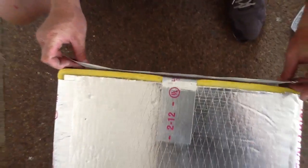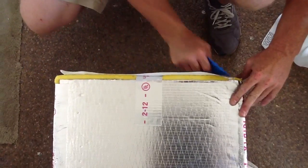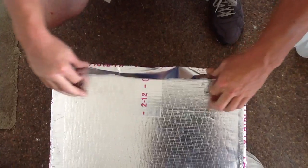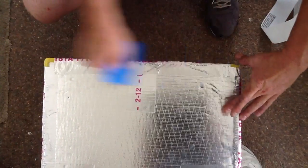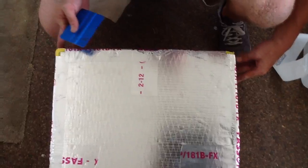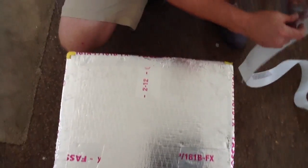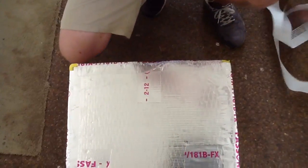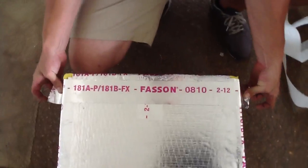See how he's putting this on? He's taping it down to the side, then he's going to take the squeegee and run it down that side. Of course, he's going to look at the lines on that side also. He's going to fold it down nice and neat. He's going to put three runs of tape on everything. He'll take another run of tape, put it on top, and half-overlap that run with the ductboard so it crosses over — that way it ensures no leak.